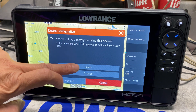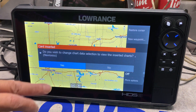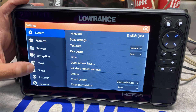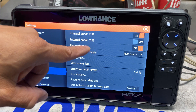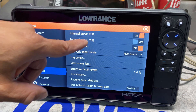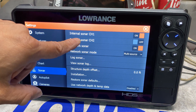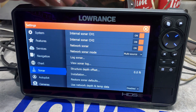This unit is now back to good. We're going to confirm it's restored and out of legacy mode. I hit the page button, the gear button, the sonar button. I've got channel one and channel two back — which I lost in legacy mode because only one port was being used. Channel one would be your blue transducer — which on a boat would be the PDWBL or PDWBL with a T code. We now have multi-source back, which means you're on non-legacy mode.